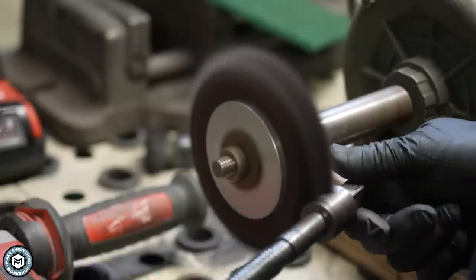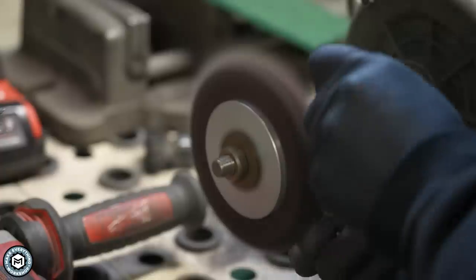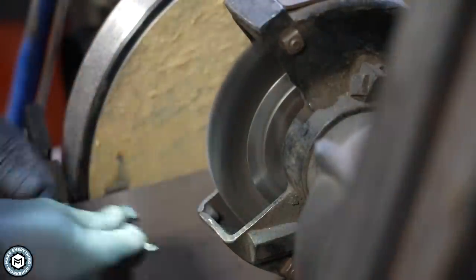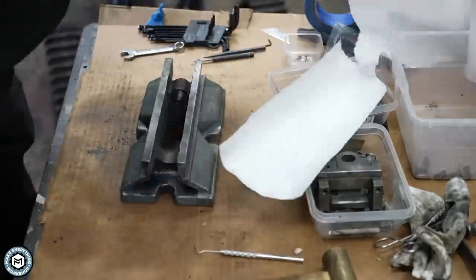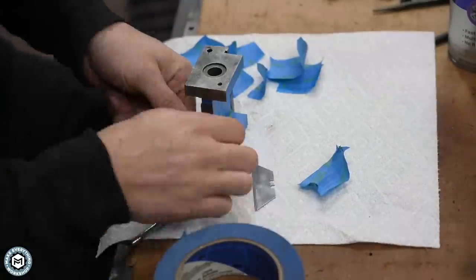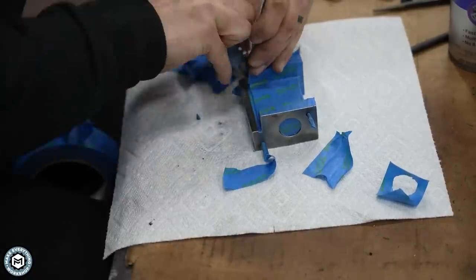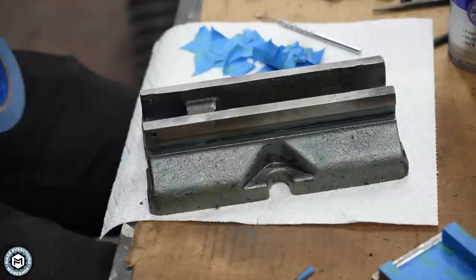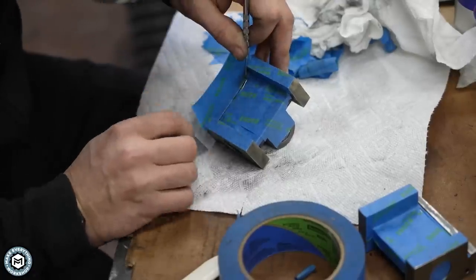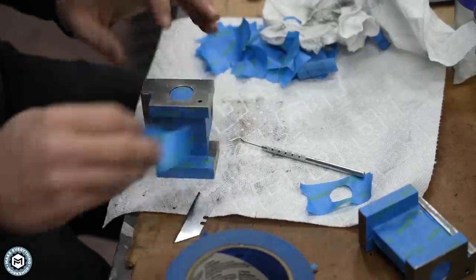The other tool I'm going to use is a non-woven buffing pad, almost like a polishing wheel, on a single-end motor. I'll also go over to the wire wheel bench and clean up whatever parts I can't use the handheld wire wheel on. Once all the parts are wire wheeled and clean, I don't need to get too crazy with getting every speck of paint off, but I do need to make sure I mask off the parts really well. I don't want any paint on the smooth surfaces that could cause binding, and I also want to make sure there's no paint inside the ball bearing reservoir so it can be filled with oil. I spend a good amount of time with blue tape — masking is the kind of thing that if you take your time on can really make all the difference and make the whole rest of the project go smoothly.